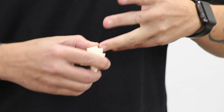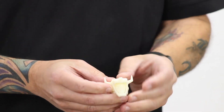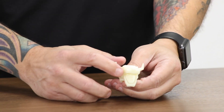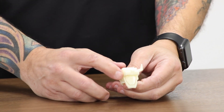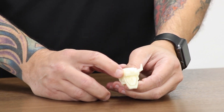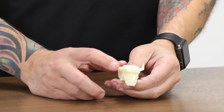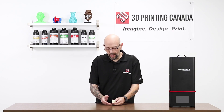It's a little snug — there we go. What's really nice about this is you can see the layer lines because we printed it at 100 microns. You can print down as low as 35 microns. It does take more than twice as long to print, but you really do get a nice beautiful print if you're printing miniatures or whatever.